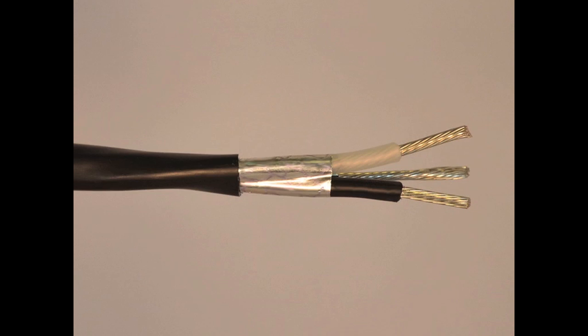The standard sizes are 18 gauge through 12 gauge. The construction of these cables are stranded copper conductors which may be tinned or bare copper with a PVC insulation. Some specifications also have shielding with a PVC or polyethylene jacket. Some of the most common loop detector specifications are IMSA 50-2, 51-1, 51-3, and 51-5.